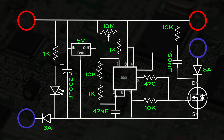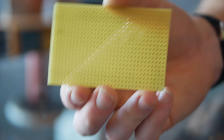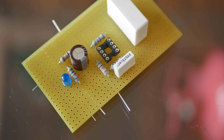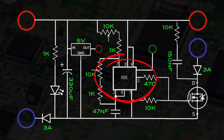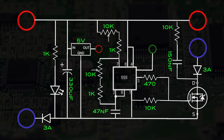The circuit is wired identical to this schematic. The 5-volt regulator provides power to Bluetooth, and this accepts Bluetooth audio. I added banana plugs for the input and the frequency modulated output. The board and the circuit could be more compact, but I need it to be a specific length, which will make more sense when I talk about the Bluetooth edition later. The operation's pretty simple: the 555 chip sends an adjustable square wave signal to this transistor, turning the power on and off to the ignition coils.